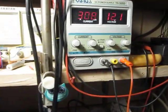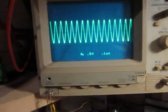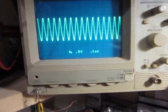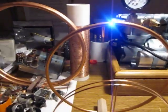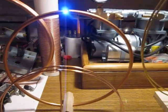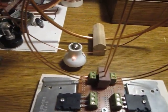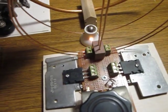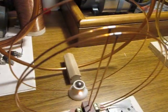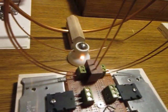And right now the current is just hovering over 300. And the amplitude is more than half a volt less right now, but the LED is the brightest. And I made another loop with an incandescent grain of wheat bulb. Okay, I'm placing it about halfway to the one with the LED, so it's about 5 centimeters, and you can see the bulb is lit.